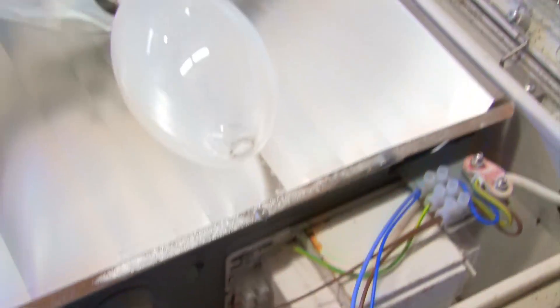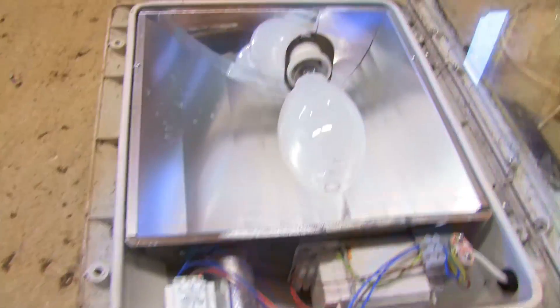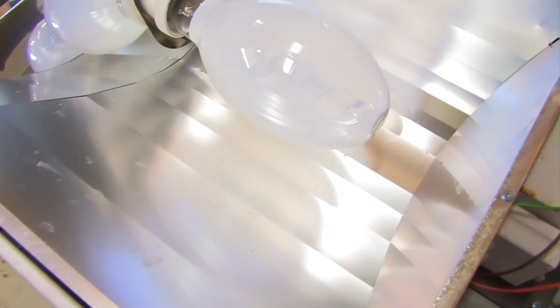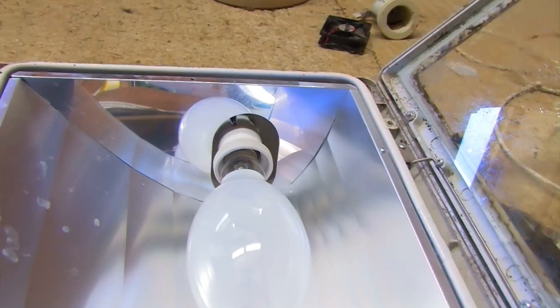It's a three wire igniter. Moving down to the ballast, it's a Tridonic again, 400 watt for sodium lamps. As you can probably see it's fairly big and composes most of the weight of this lantern. Just to note, the reflector isn't made up of millions of little mirrors — it's just made from a flat plate of aluminium. The rabbit is getting quite interested by all this, but I'm going to have to lock him away so it's safe when we switch this on.